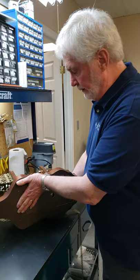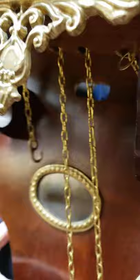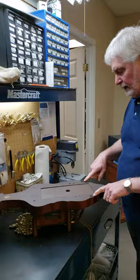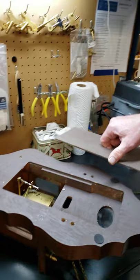When I've got the clock turned over, you'll notice a few things. First of all, whenever I move the clock I always have the chains pulled right up as far as they'll go so the chains cannot come off of the tracks inside — pulled right up to the stops on both sides. The other thing you'll notice on the back of the clock is that I've put two little non-skid pads on here, which stop the clock from moving from side to side once it's up on the wall. That's important because you don't want to be resetting the clock every time you pull the weights up.